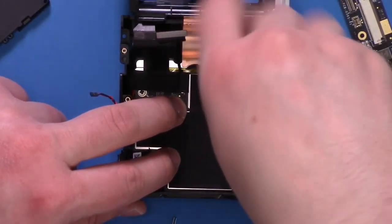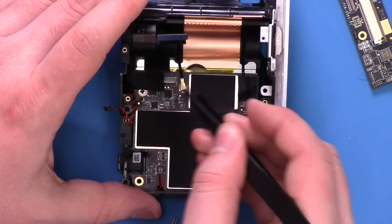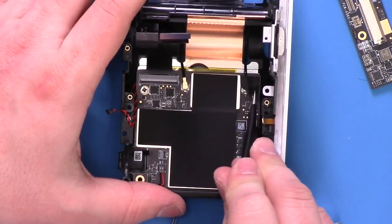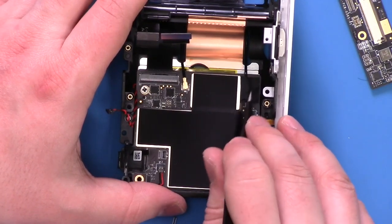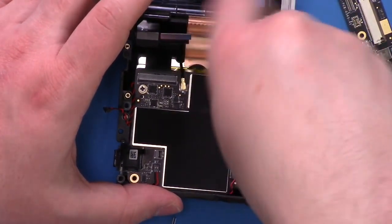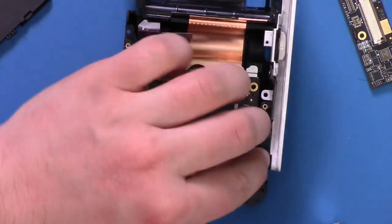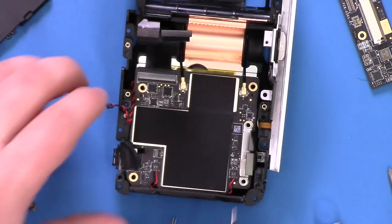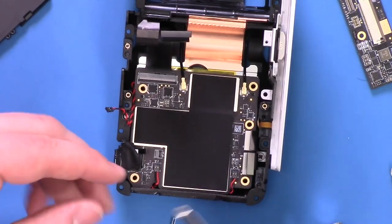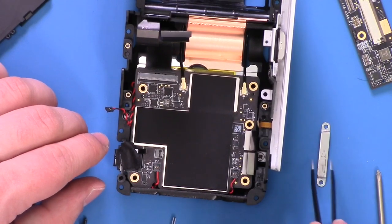We can also see - a while back I had claimed those things that look like maybe antennas. Now I'm more confident - yes, those were antennas. You can see they're going to these RF connectors. Also, if they were some sort of anti-tamper thing, I would assume they go to the security board. So what I'm assuming here is this is sort of a more general purpose board. Just based on the effort put into the other one, I think it's fair to assume it's doing less security-critical work.